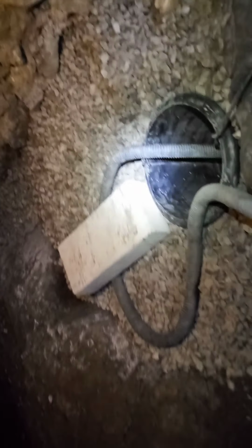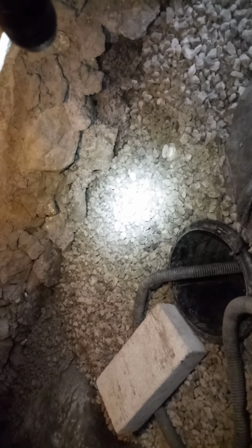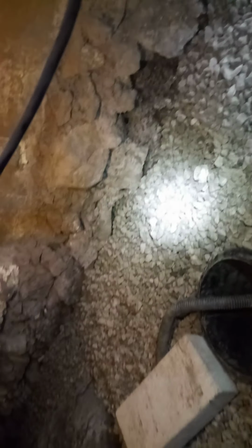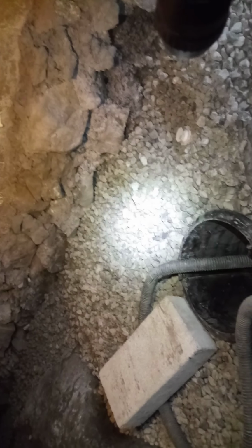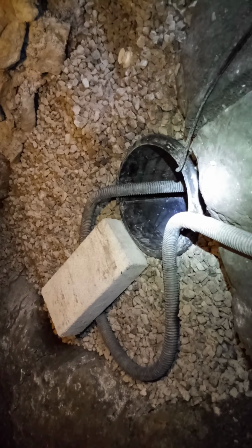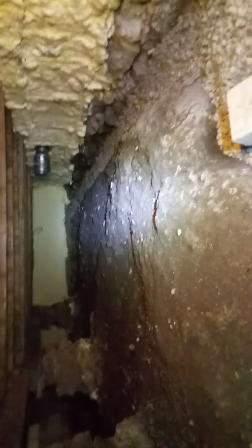So what I did was I had this all dug out because I had to replace all this with PVC underneath it here, and then connected that with some 6-inch PVC elbows and all that stuff. So all this is new plumbing down in here. You can see there where I got that connected to the old cast iron with the Fernco. And then down there is all PVC to some clay. I had just enough clay sticking out that I could take an angle grinder and cut it all off and then connect that. And then next to it down here, I had a big, real deep hole dug. And this was a whole mess. I mean, this took like 6 months to do all this. Constantly babysitting and all that.